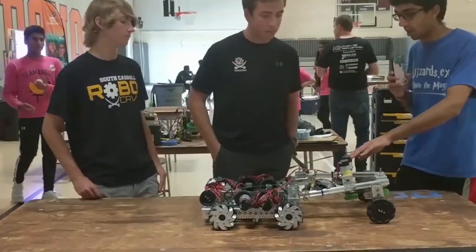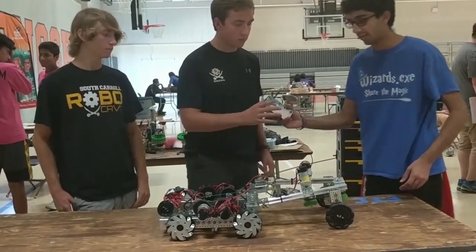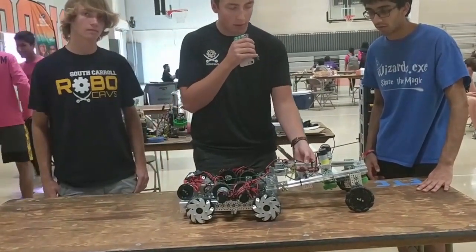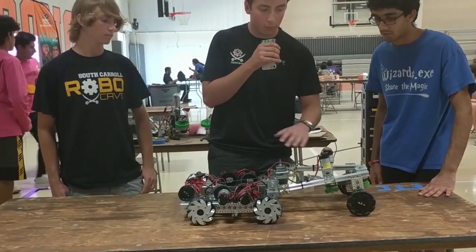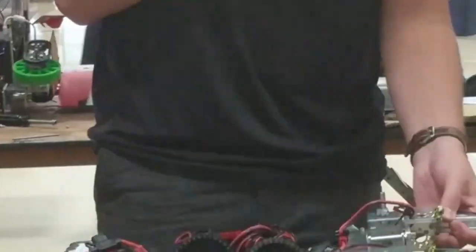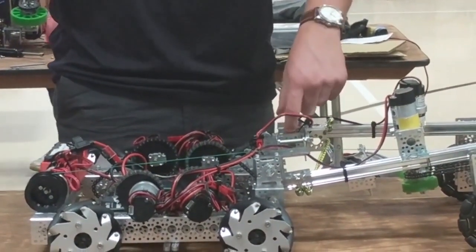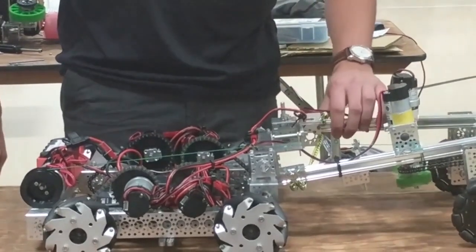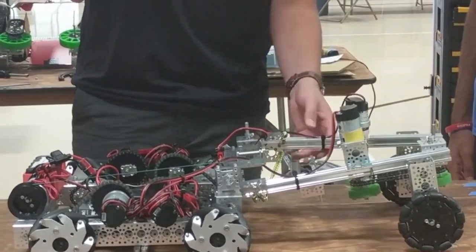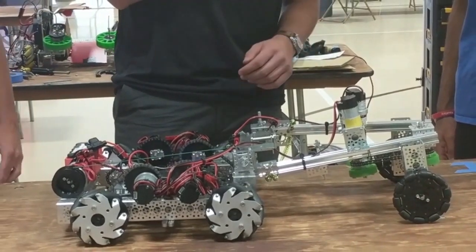So I see your spring-loadedness — how did you get the spring-loaded mechanism working? Can you show us the parts you use? Sure. So we use actually a bungee cord and the Actobotics x-rails just to make it really easy to adjust where everything is. We made this a pivot mechanism with a pillow block inside of this channel, and that allows us to pivot this side. The other side is sturdy so it doesn't just move everywhere for the stones. So this is a really fast collector.